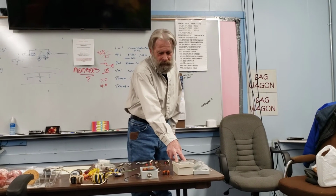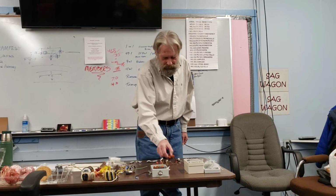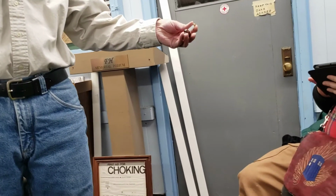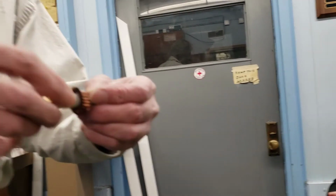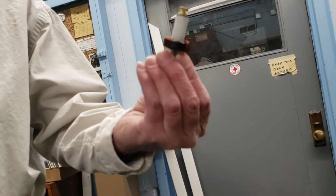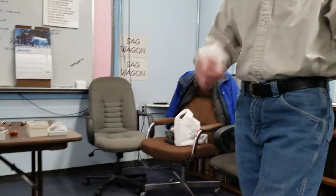240 is the 2.5 inch one. This is a 140, and then this little thing here, we bought this. This was made by somebody in their garage, and they turned it into a business called a spark plug antenna. Basically, it is a BNC connector super glued into a piece of PVC shoved down into the middle of a smaller toroid wound with ultra light wire, and then out through the top is a brass screw where you hook on the wire for your end fed. Looks like a chair.